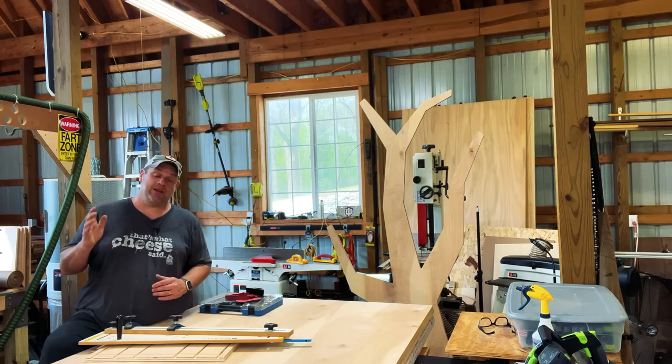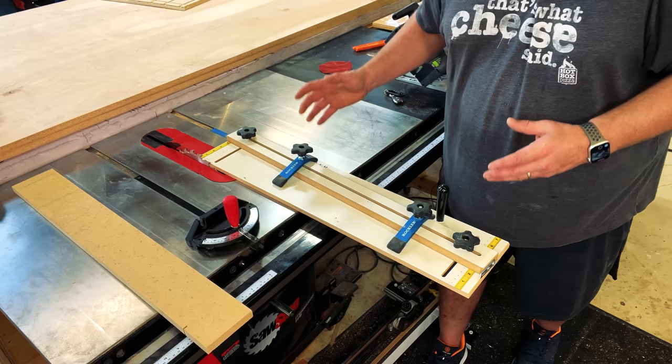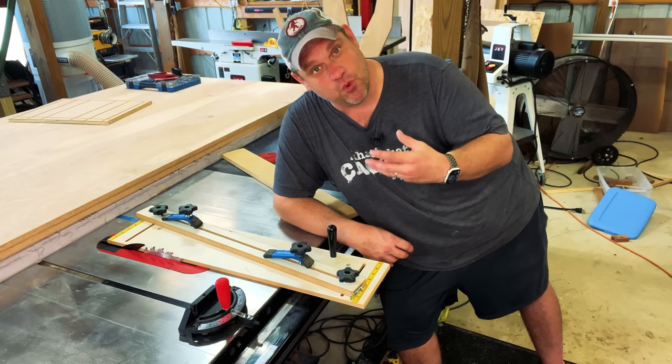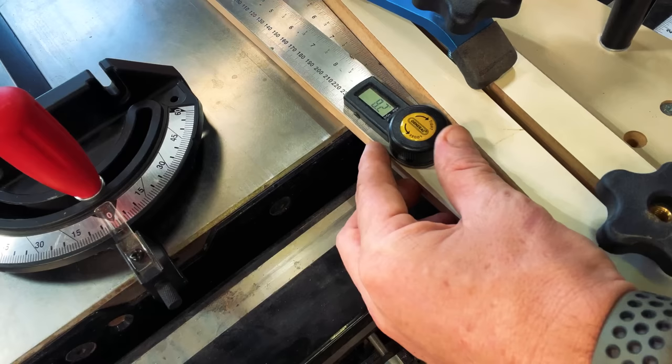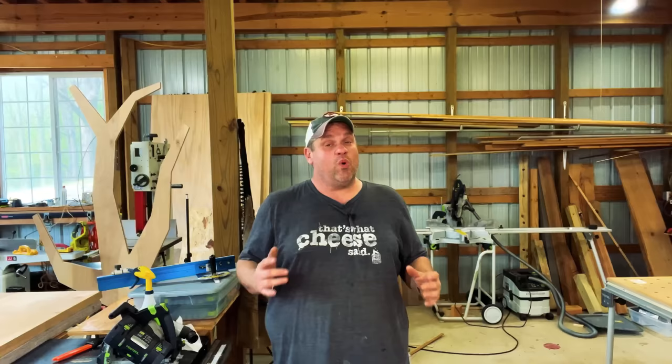One of my favorite profiles to put on any furniture leg is a taper, and that's why I purchased this next item. You may have seen this jig on other YouTube channels — it's the Rockler tapering jig, a high-quality jig that allows you to put tapers on things like chair legs. You place the piece of wood into the jig, clamp it down with the two clamps, and run it through your table saw. I really think this is a great jig for modest tapers; however, if you want more aggressive tapers, this jig won't do it. Extended to its max capacity, you're really only looking at a taper that goes to about 8.7 percent.